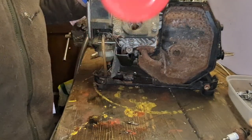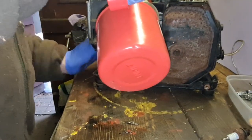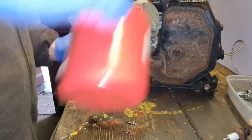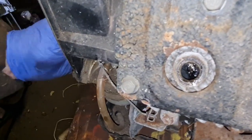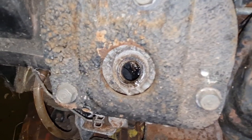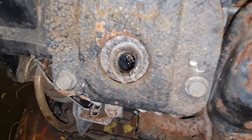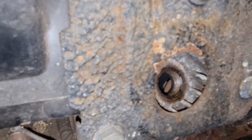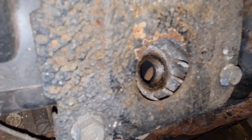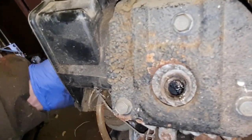Before we start doing a lot of pulling, can we see the piston in there, or are we on the valves? I can see a valve in there, look. Seeing that plug hole, there's a valve. That valve is doing nothing. So this has either got a sticky valve, or something's broken in there. That valve's opening, look. See that one there opening? There you go. That valve open and close, look. See that? This one, stuck.